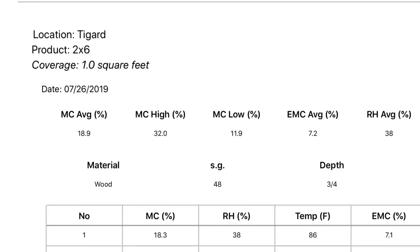Generally across the board, 2x4s seemed to be a little drier than 2x6s. The exception was Bend, where 2x4s averaged 15%. For a quick overall answer, the overall average was 14.3% across all the Lowe's and Home Depots, but it varied a lot. In Tigard, readings were 12.6% and 13.3% for 2x4s and 2x6s.